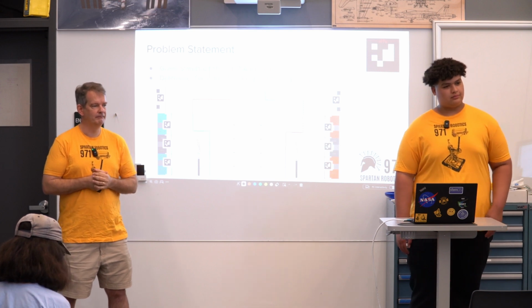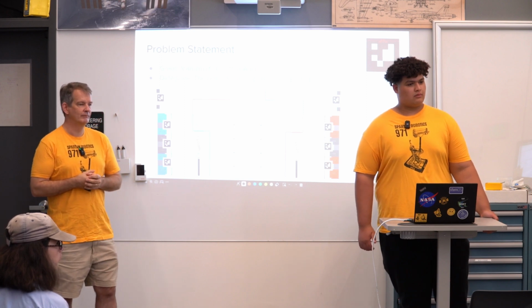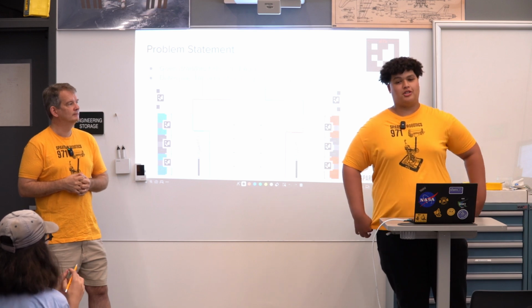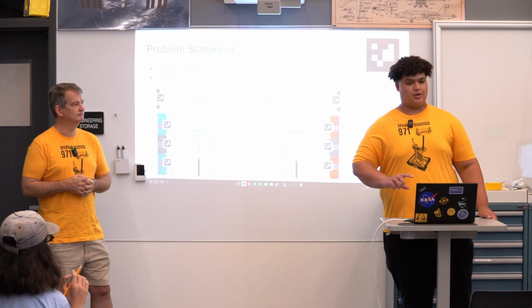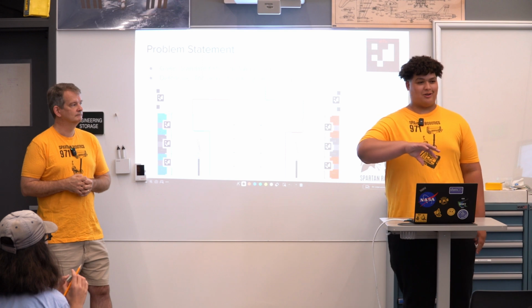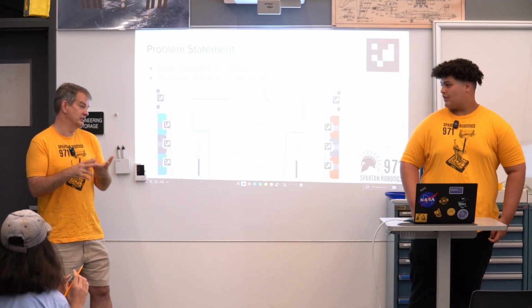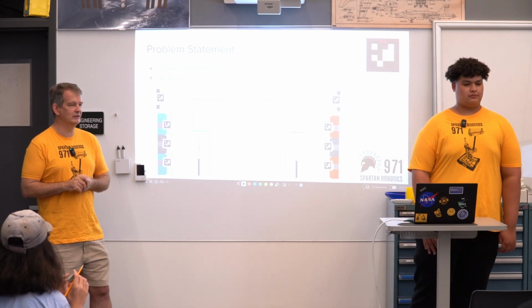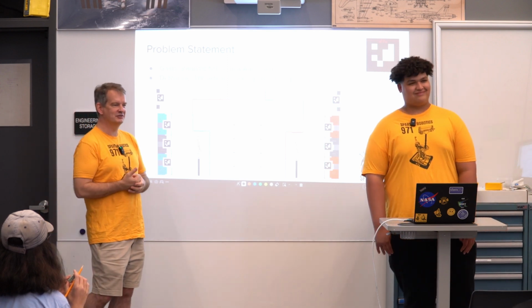Have you guys started using other sensors like accelerometers to determine the position? The question was, have we thought about using other sensors like accelerometers for our position? And we do. On the IMU, we have an accelerometer there, and it helps us with our position, because we also have the battle of doing our rotation and where we're going as well. It's got an accelerometer and a gyro on it, and we've got pretty good IMU data coming off of that that gets fused in. And again, that's a talk in the next session about localization. Learn more about that.